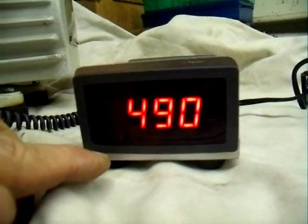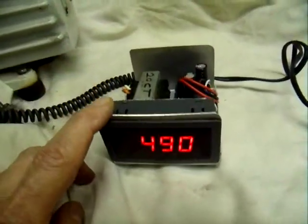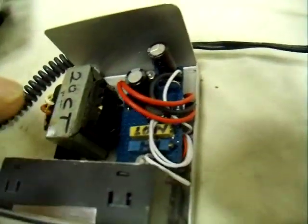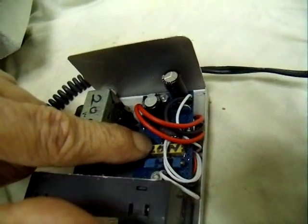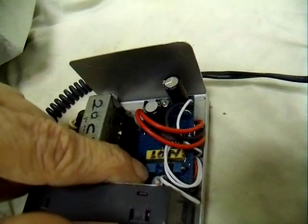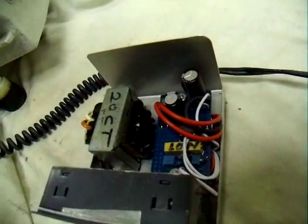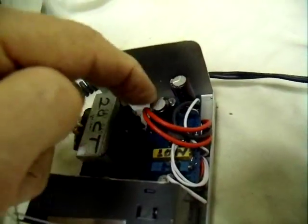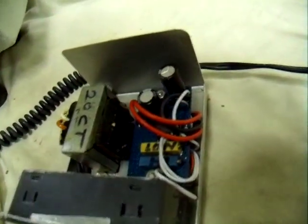You can turn the decimal points on and off very easily — it's all straightforward inside. We took that meter and made a little circuit with an op amp and a couple of trim pots: one for offset on the very low end and the other for the span — the full scale. So it's just a very simple circuit using an op amp — offset and gain is all we have. We made it on a piece of perf board; it was just too simple to warrant a circuit board.